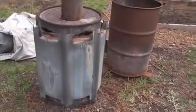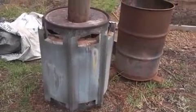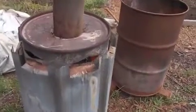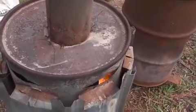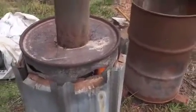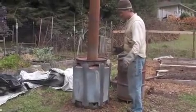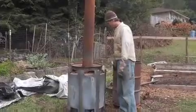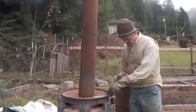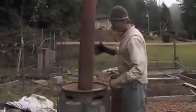We're a half hour into the burn now. You can hear a nice clean sound of the roaring flame, which is mostly the gases escaping. If you can see down in the hole, the gases escaping from the inner barrel are burning all the way around, baking it and driving out more gases, and the emissions are practically nothing. So it's been about 50 minutes, and there's no longer any sound of the gases igniting. I can look down in there and see there's no more flame.